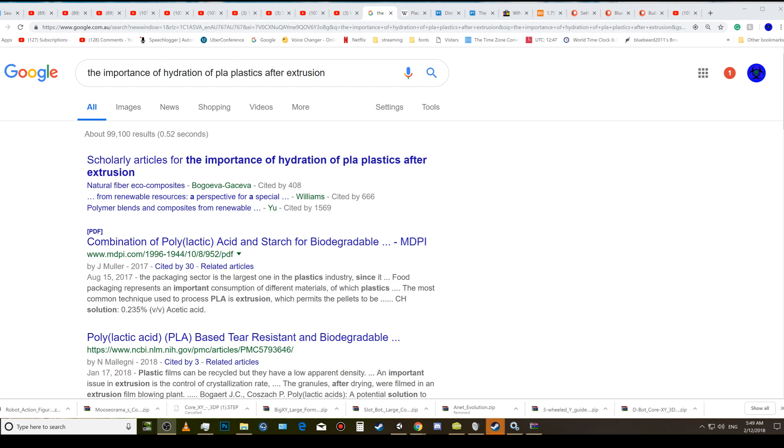There are different approaches people take. Some factories simply throw a glass of water into a bag of the product — that's poor rehydration. A proper rehydration process means parts should come out of the injection molder and go into a water conveyor belt — they drop into water with a conveyor belt on top and underneath — which keeps them in the hot water for a certain period of time. We rehydrate plastic because we've just taken all the moisture out to mold or extrude it, and we've got to put moisture back in to strengthen the plastic. The molecules of the plastic will not stick together unless you rehydrate it.